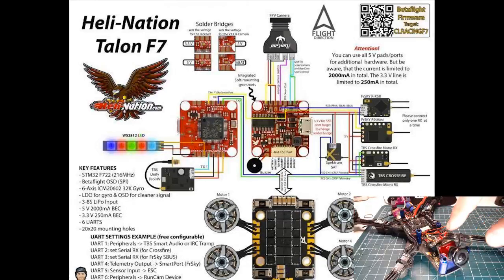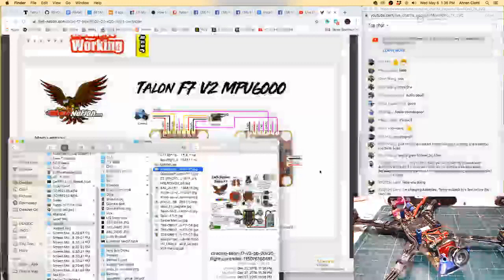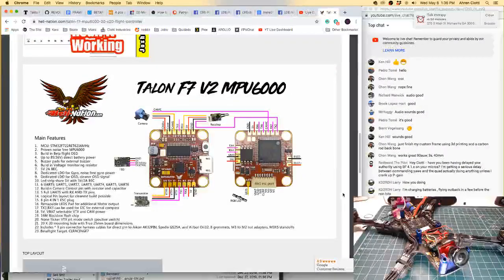So this is to the side of that fella there. It's not the closest side on the chip. It's the second closest side on the main processor, which would be the top on that drawing, right? Yeah, it would be the top on the drawing. So what do we got? Ground and 5-volt. And then, hard to tell. Ground and 5-volt. And then you know what? It's going to be much safer to just pull these off and then use the new diagram. I'll just trace them back. This is going to be fine.